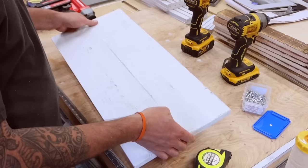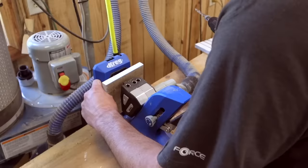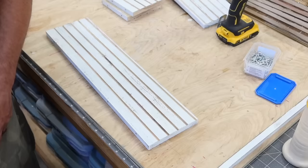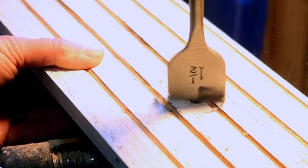Now let's put some pocket holes into our two sides and our front board. These are only going to be on the bottom — this is what attaches to the bottom board, holding everything in place. The back wall will not need these because we will be making it removable for clean out. Now let's go ahead and cut our holes in our front wall. We're going to space these at two and a half inch increments from the very edge, and after measuring down to the center of your board, take it over to the drill press. If you don't have a drill press, you can easily do this with a spade bit and a drill.